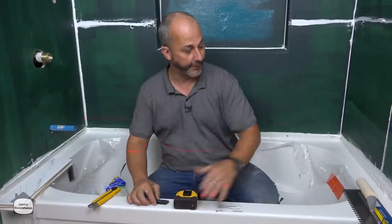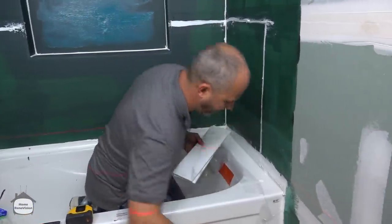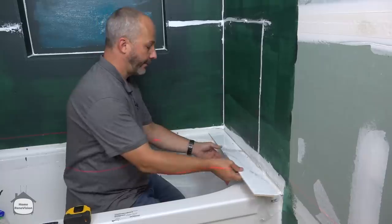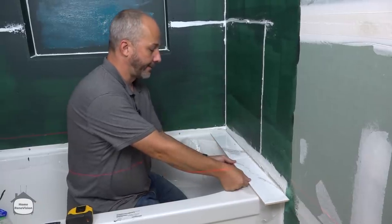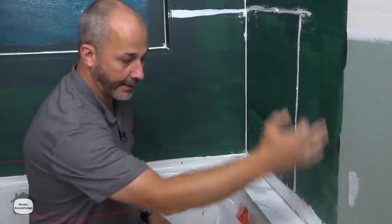On the other side we can go with a full tile and half tile, and then on this side — just to keep things simple so we don't have so much cutting — we will lay out two full tiles, and then just go with a half tile, full tile, half tile, and use a decorative edge.